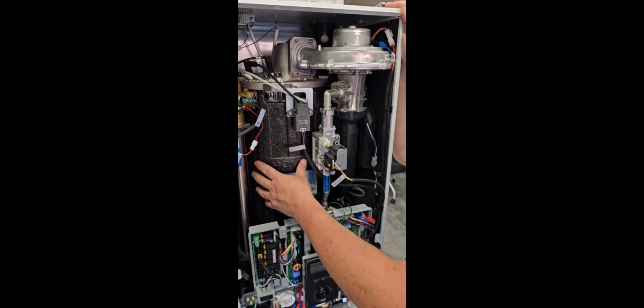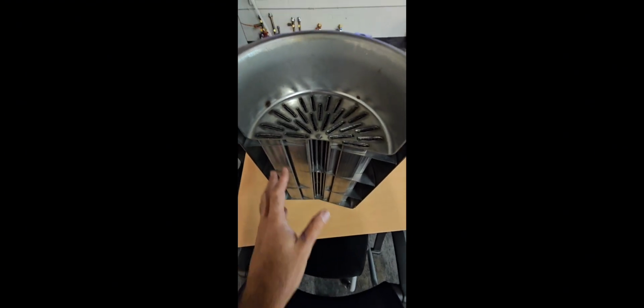Okay, so Mike was explaining the fire tube boiler over at the actual boiler. This is a cool cutaway. And if I spin it around, essentially, if we're going to break this down to basics, this is a fire tube heat exchanger. We're going to send basically the combustion or the flames down through these tubes, and the water is going to surround it, because you can see my finger right here. The water will surround it, and we're going to send the heat and the combustion gas or fumes through these plates here. That's correct.